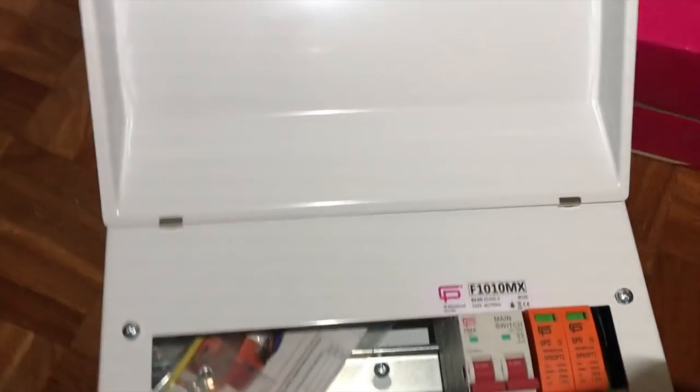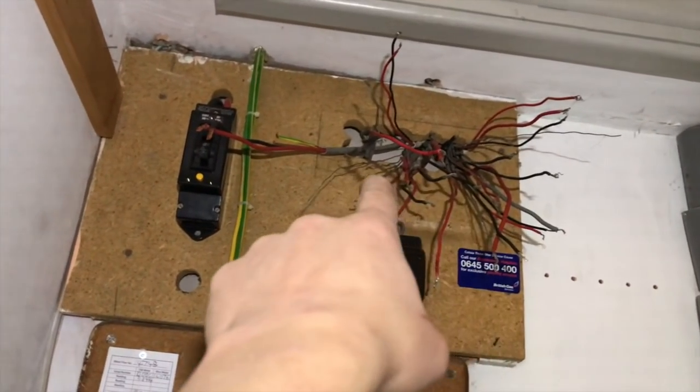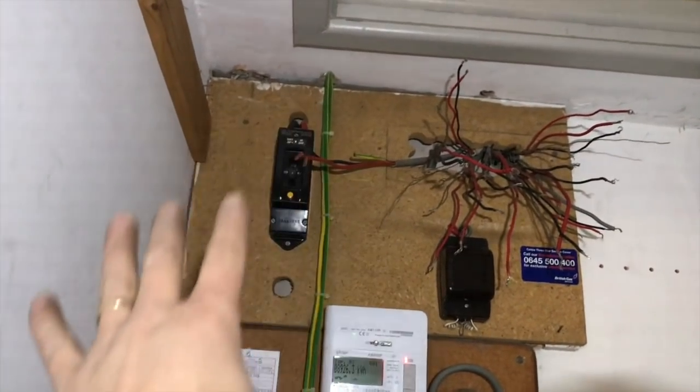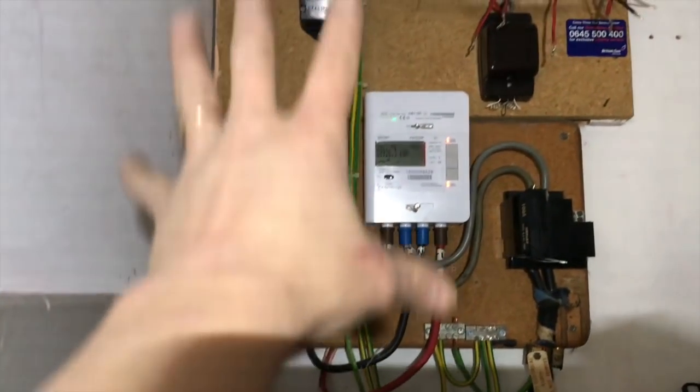All I'm going to do now is get the board unpacked, and then I've got rear entry on this one. I know a lot of my boards are top entry, so it's quite nice to have the rear entry coming in the back there, so the grommet strip. And the mains tails I'm going to bring surface rather than tucking them behind, because this is still awkward. Bring them surface, and they'll go into the new switch wherever I mount that.